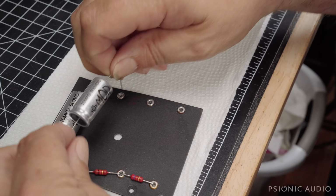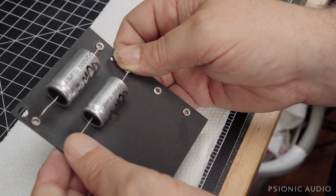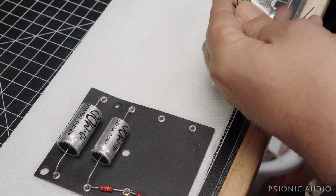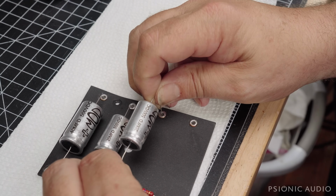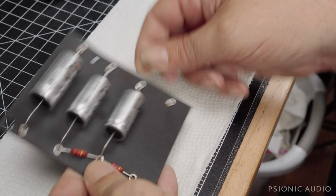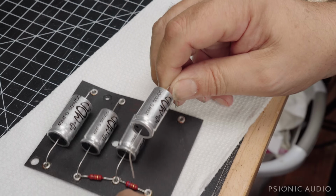The next recap in 20 years, the problem will not be removing that silicone. The problem will be figuring out a way to fit radial caps in this old axial doghouse. Maybe someone will make a radial to axial converter in the meantime. I've been thinking about building some kind of PCB direct retrofit thing for situations like this. But the trouble is there's just so many models of Fender. There's so many variations on what the parts are, how many parts there are, where they go.